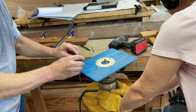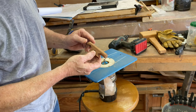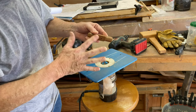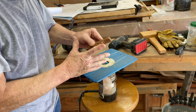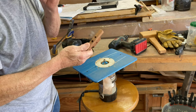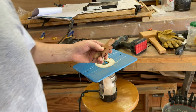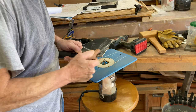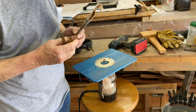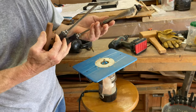We left out the boring details of rounding over the straight parts and listening to the router. Now we'll be hand sanding this. It's roughly the size of a cleat with a pretty good-size base that we're going to epoxy to the hull. We'll round this off a little more with a file. Here's a tip: a screwdriver inside a piece of sandpaper — depending on how big a groove you want, you can choose a different size screwdriver.